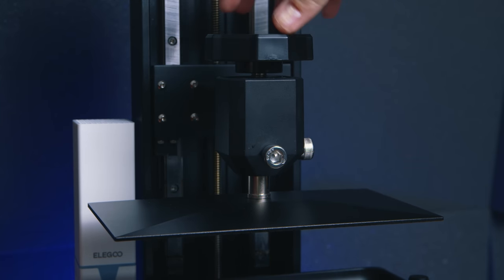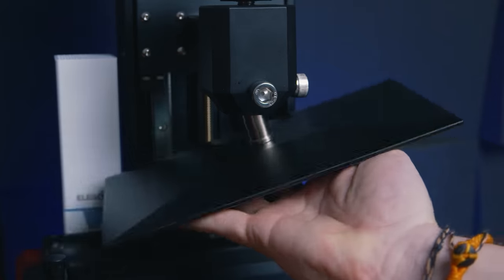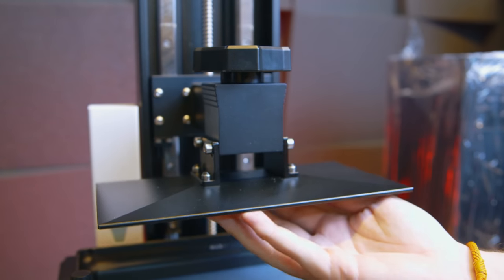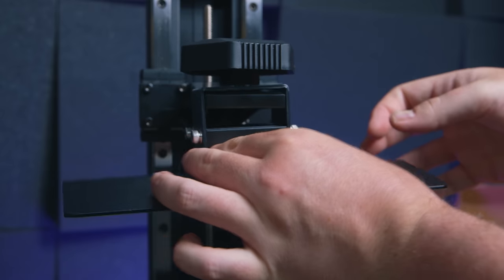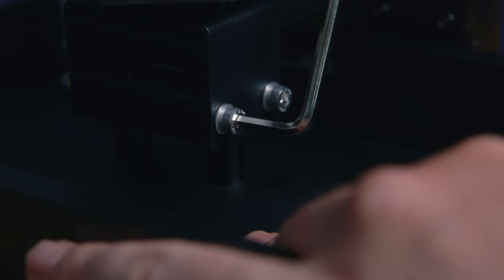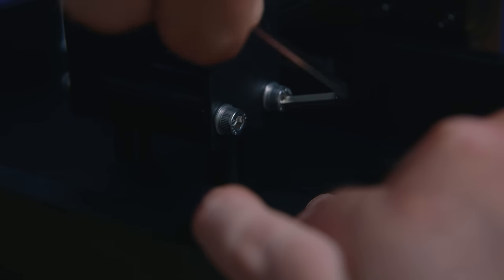Let's talk about the levelling mechanism. The Saturn 3 has Elegoo's traditional ball joint, which I've said in many videos is prone to coming loose more often than the mechanism we're about to talk about, and many commenters have agreed. The Ultra kind of proves that point, because the better mechanism is the four-point screw system found on this printer — considering this is the mechanism Elegoo decided to use on their premium printers. The basic M5 has the same mechanism, though since my review I've found that either the bolts or the thread seem kind of soft, especially compared to what the Ultra feels like.